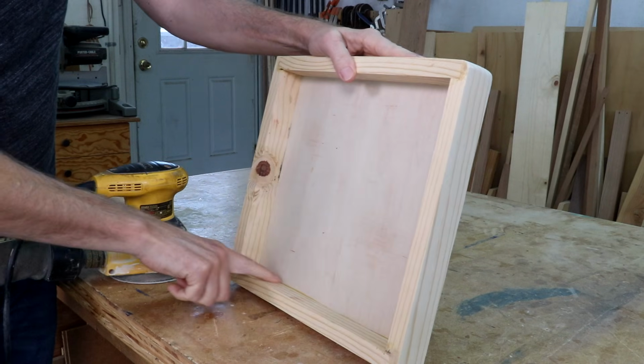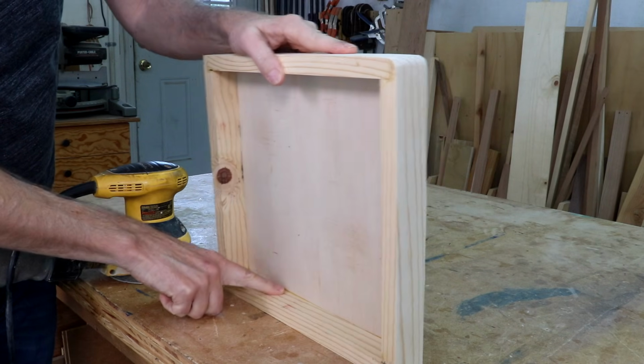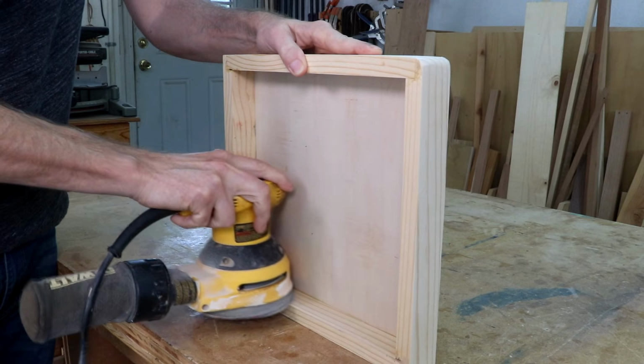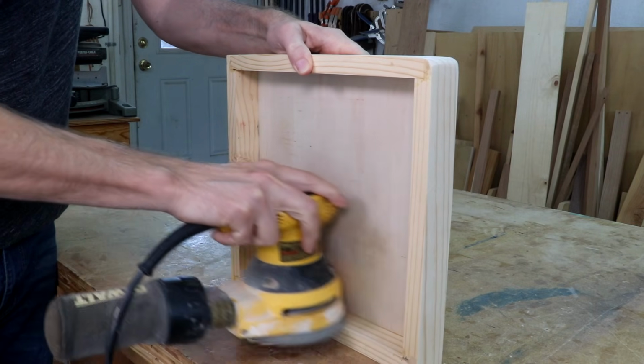It doesn't take long to figure out that a round disc will not be able to sand inside corners, but what we might forget is how difficult it is for a random orbit sander to sand all the way to the edge of an inside surface. Let's say you're sanding the bottom shelf of a bookcase. That's the non-removable one. You might want to sand right to that back edge or the side edge, so you run the sander along the surface pressed against the perpendicular side. And what you discover is a gouge all along that surface where the edges of the sanding disc rubbed.